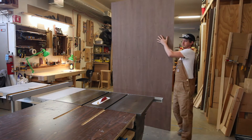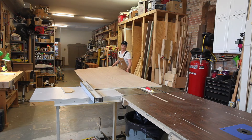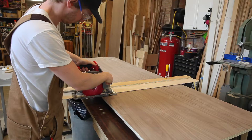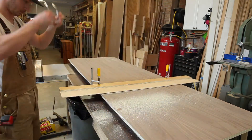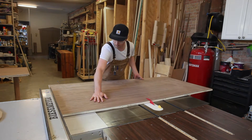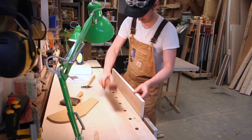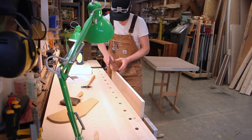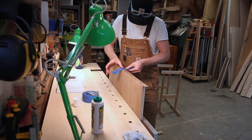Welcome to my new video. I'm going to be building a walnut dining table. The design elements are going to be pretty modern and minimal. It's one of the first larger jobs I've gotten through an interior designer. The tabletop will be solid walnut, six foot by six foot, and the base is going to be a pedestal base using walnut plywood. The top gets radiused corners, and I wanted to match that design element with the base by putting solid walnut on each corner and then giving it a half-inch round over, so it gives a cohesive roundness to an otherwise sharp and angular piece.